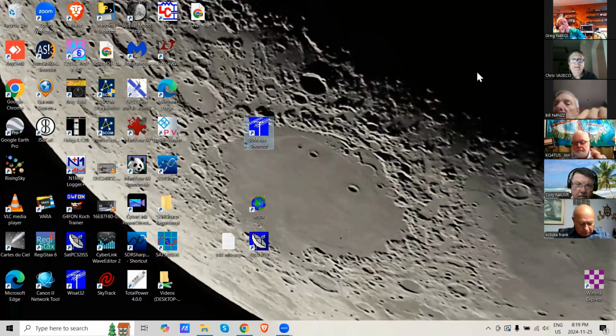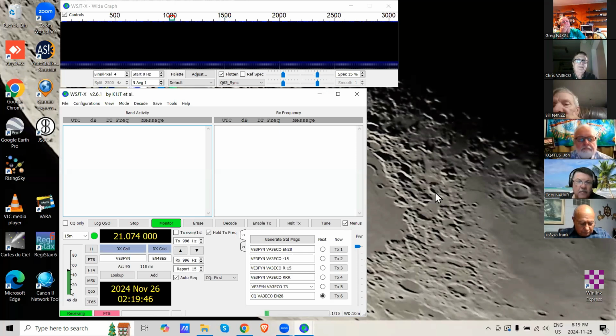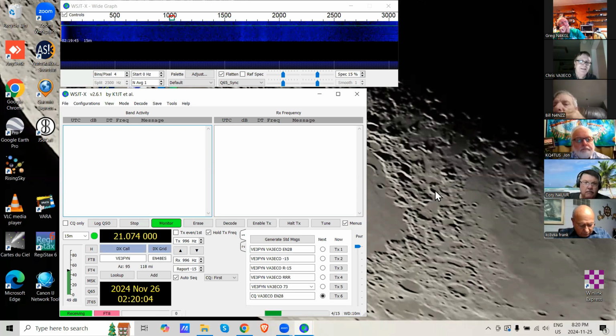Okay, so now let's get into WSJT, the workhorse. Now, do you need to do it with WSJT? Years ago, people did CW, and they still do it now. It's workable, but it's tough. These WSJT modes will give you, probably, just off the top of my head, 15, almost 20 dB more sensitivity. And as I've said before, every dB counts. Well, to get a lump of 20 dB, hey, got to do it.